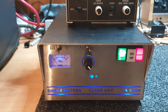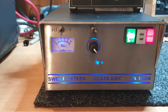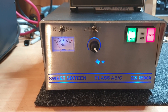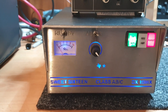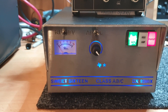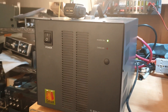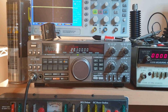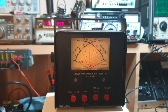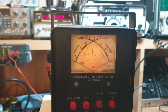Righto, a fair bit of setup involved in today's little look at an amplifier. This is the Sweet 16, and those of you that don't know this amplifier, it's an oldie but a goodie. This is the DX1600X and we're just having a bit of a look through at some issues that this one's got. We've had to set it up with a QMAX 120A supply and I'm just using as a driver an old TS440. We've got metering monitors registering the input over here and registering the output over here.